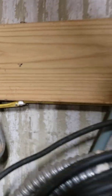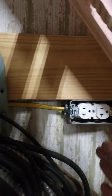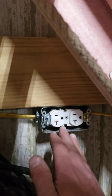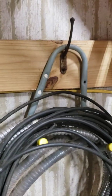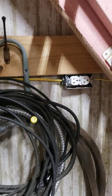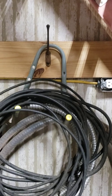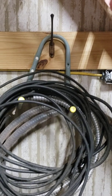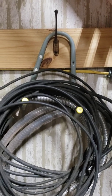So what I want to do now is take the plug out of here, disconnect all this, and run a brand new piece of wire from this box over to this box right here. And like I said, the best thing to do when you troubleshoot an electrical circuit is to break it in half — go to where it ends, then go halfway, break the circuit like I did here.